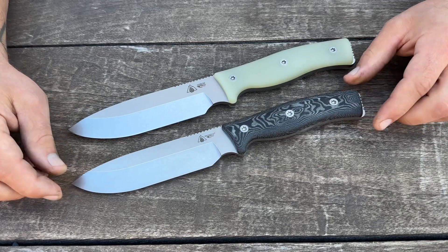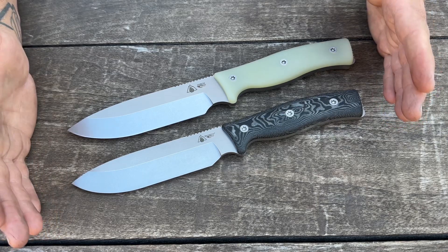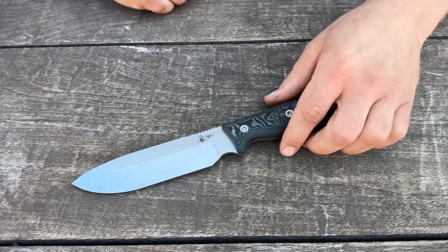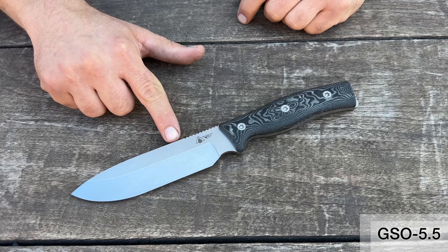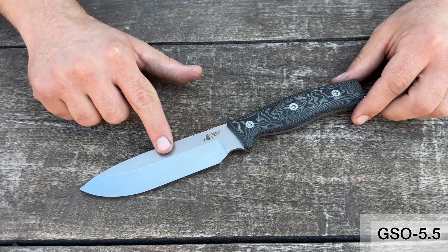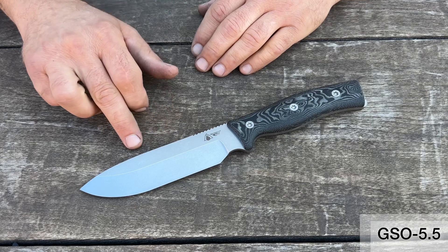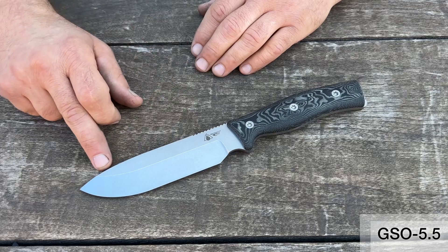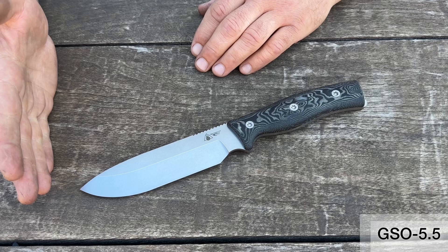With this, we chose to go a little more camp-oriented since we do have the 5.3 and some other offerings coming up. We've chosen to go more camp-oriented with all the little design points. We have a 170 thick blade stock here — it's a little bit thinner and more efficient. Relatively speaking, we have a higher grind so there's less included angle, so it's going to slip through material a bit easier. And then we have a higher, more baton-oriented spine. So if you're trying to process campfire wood, things like that, it's got this higher spine that's going to take batoning a little better, a little more squarely.